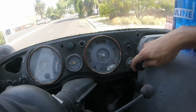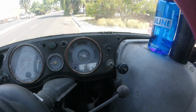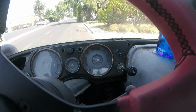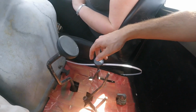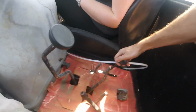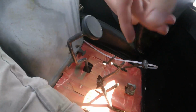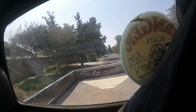And you can set the idle with the hand throttle. Feel it. Sounds happy. We go backwards: clutch in, main transmission neutral, Johnson bar to reverse, make sure you're in crawler range, and you go backwards. Only in first or second gear though.